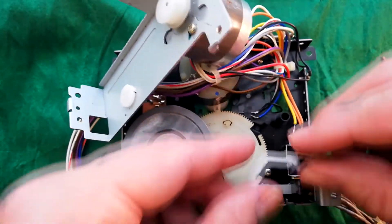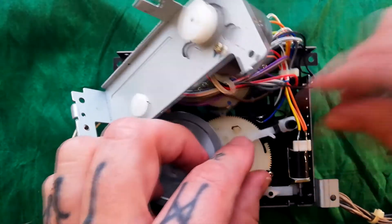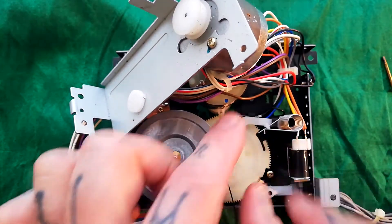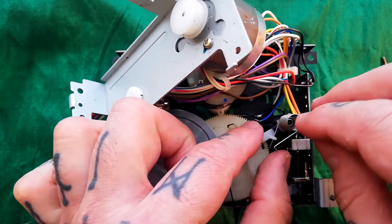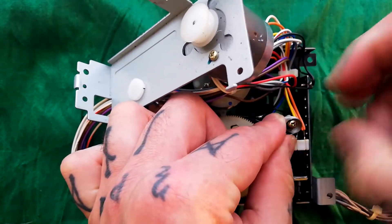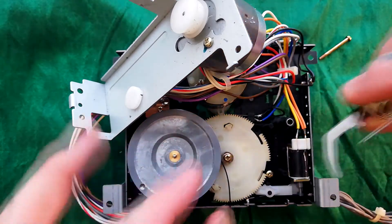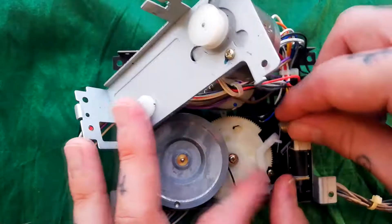While I was talking, all the bits fell out, so here's how they go back together. The white part is at the bottom; next in goes the spring with the straight arm at the bottom, and that straight arm slots underneath this little white tab. Then there's a part that goes in the center — it was inside that black plastic part for a snugger fit for the screw. You'll see the black stripe on the white arm hitting up against that black plastic post.